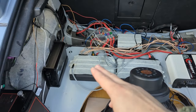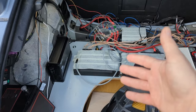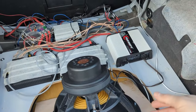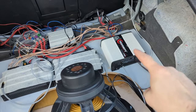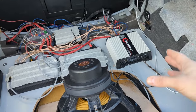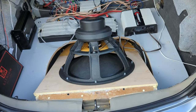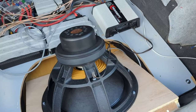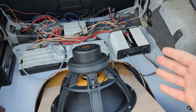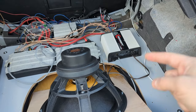If you have an amplifier that can do much more than you need, it's not a problem at all. It's exactly the same with the amplifiers feeding the mids and tweets — I have 75 watts for mids and tweets and it's overkill, but totally fine. Everybody has more power than they actually need. This one has 3 kilowatts available and I've tuned it down to around 1000 watts max for this sub. It doesn't struggle at all, and the THD is kind of surprising on this one.